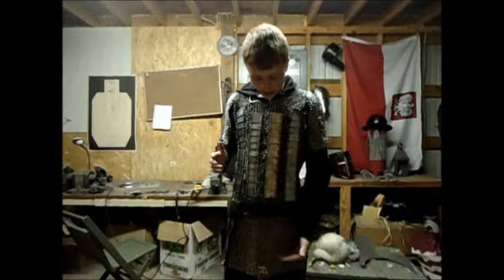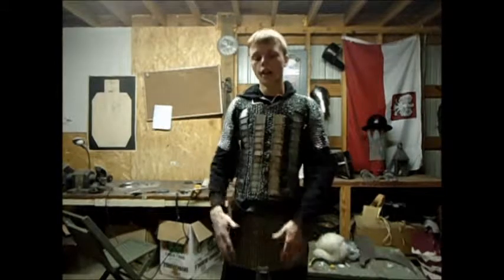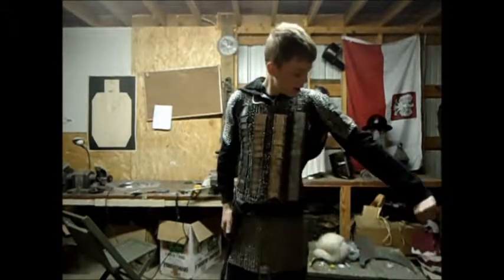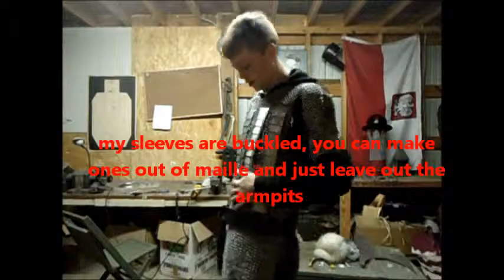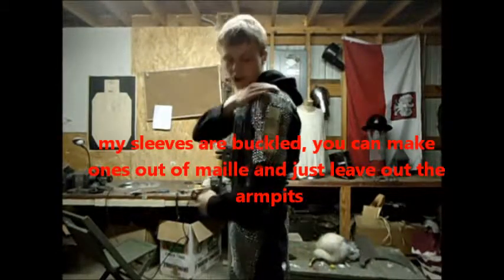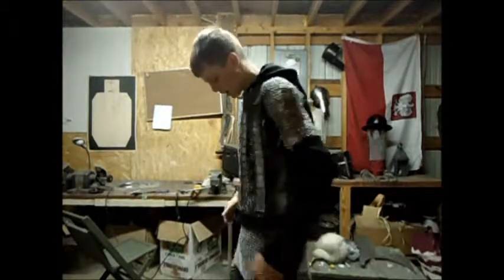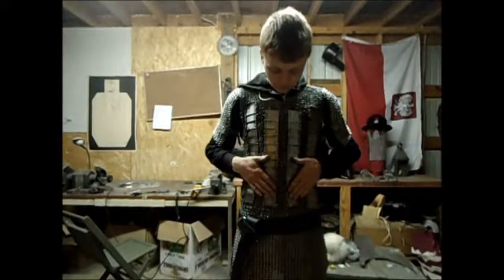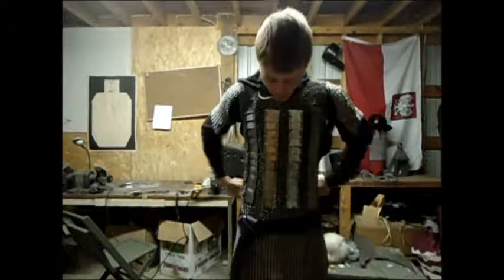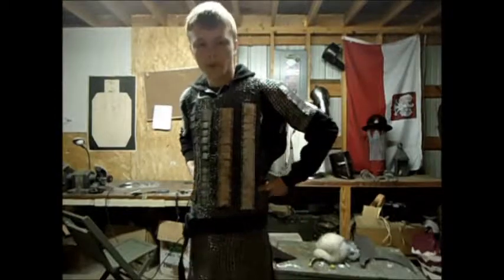If you're going to have stuff come down, it's best to wear it tightly to transfer some of the weight off your shoulders onto your hips, which might be much more comfortable. I've also added sleeves, but the plates really aren't very flexible — they only flex a little bit — so my sleeves have a lot of chainmail going over the shoulders, since it would be uncomfortable to have plates there. One thing you can do is use 16 gauge in the back to make it lighter, and 14 gauge in the front to make it stronger, so you've got protection right where you need it and less weight on the back.